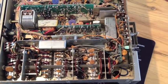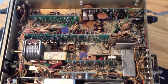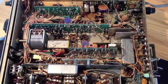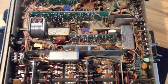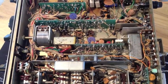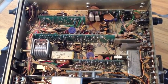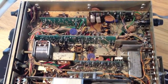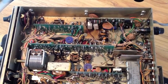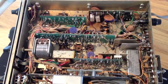It does work okay otherwise. We're going to do a couple of mods. I heard that you can actually use TR7 filters for the first IF, and I have a couple. Sherwood doesn't make the sideband filters anymore — they still make the 600 CW filter — but you can get them from International Radio. Since I have a few for the TR7, and there's a mod out there on the Drake list on Yahoo Groups from a ham in Europe who's done it, and it looks fairly simple, I'm going to give that a whirl too. That will be in a later video.